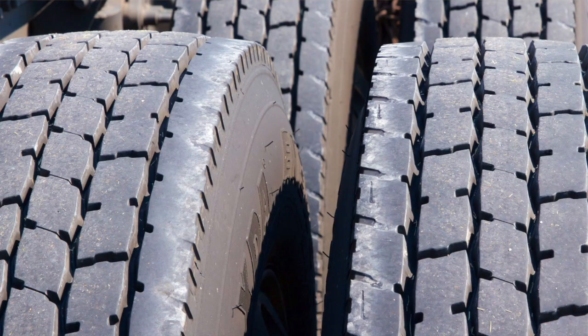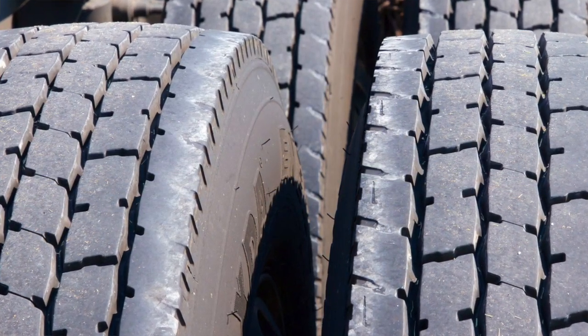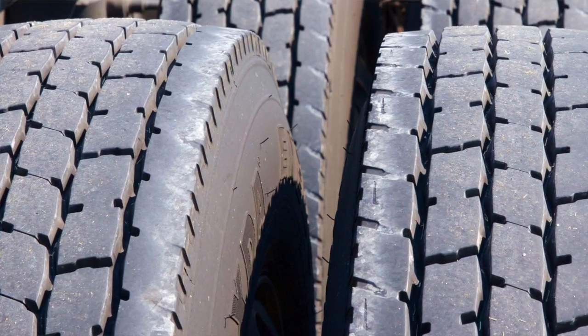One of the things we've done is purchase recycled semi tires, where the sidewall was cut out and we were provided with what's called the tread cylinder — the actual tread. What you do is lay that down on your filter fabric and backfill it with rock. When you come across it with the front end loader, you're not hauling away any rock because you can't go through that inch-and-a-half thick rubber band. That's one approach.